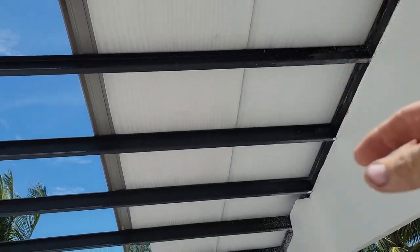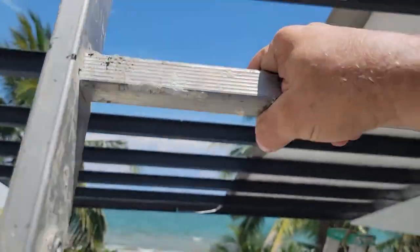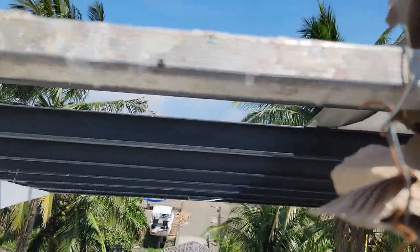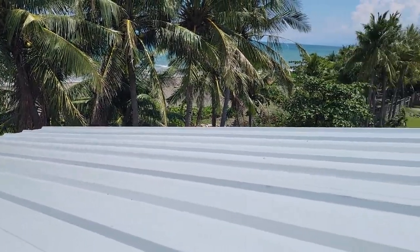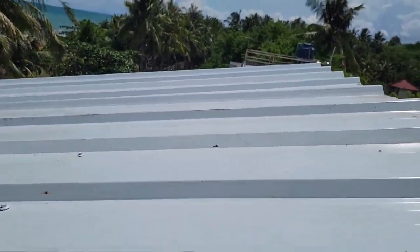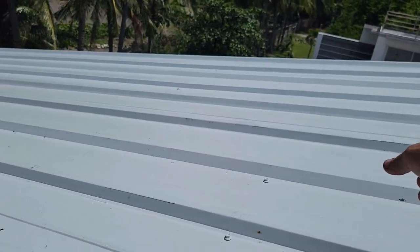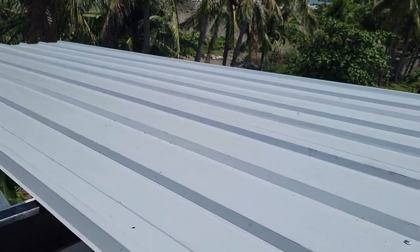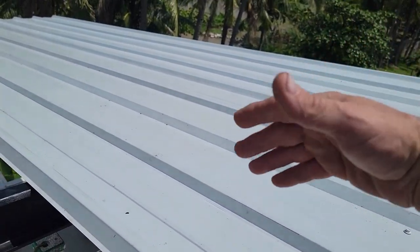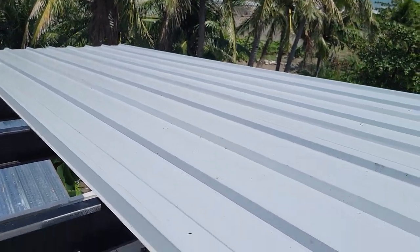So there's our insulation. It's overlapped about an inch and a half down through there. And I'll show you what I've done here so far. You can get a side of the roof. We did not put the butyl tape between these first sheets yet. For one thing, they don't have no experience working with it. I left the sheets loose where it could be rolled back and put in there after the fact. Plus, we're trying to get these first ones here to work with.